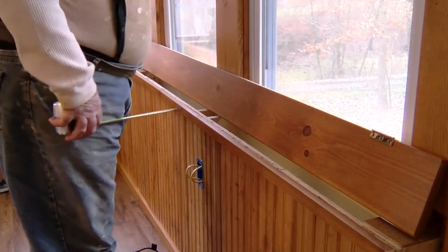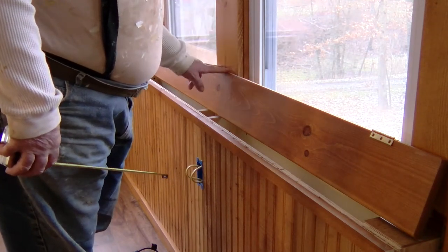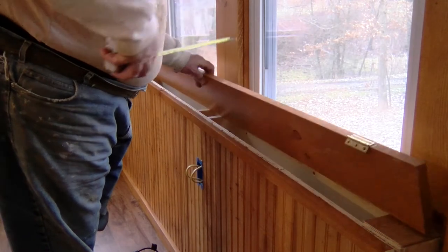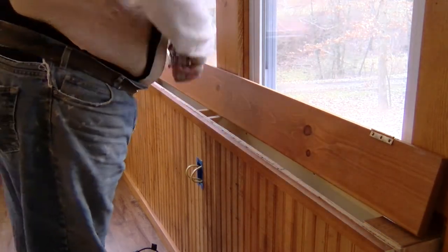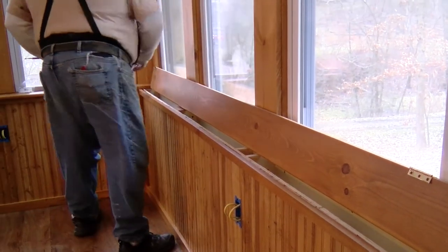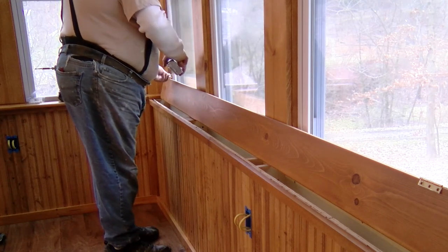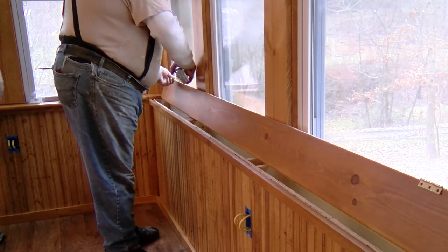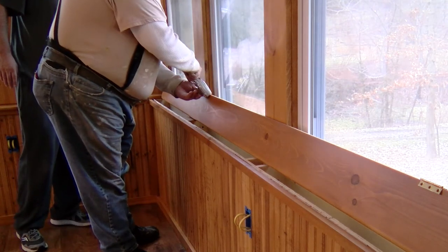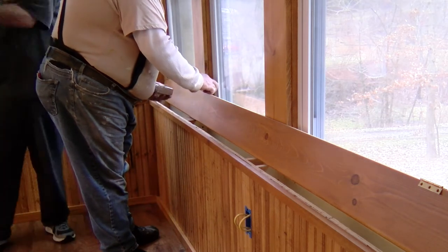Now the only other thing that we want to make sure is that our hinge doesn't fall on one of these panels, because it'll end up binding against the panel. So see where 35 rings on this one. Look. All right, 35 is right here, so we're just going to move it over to this spot here.